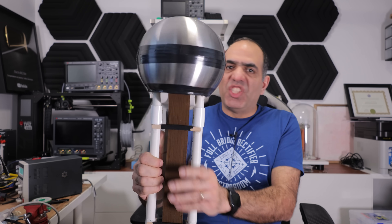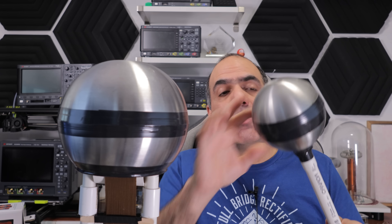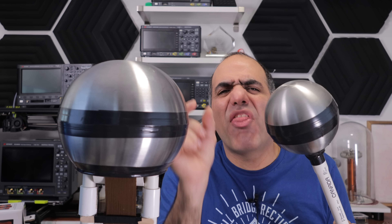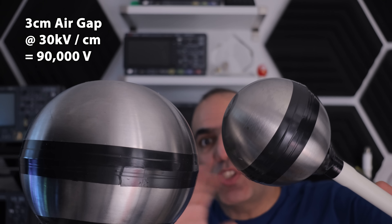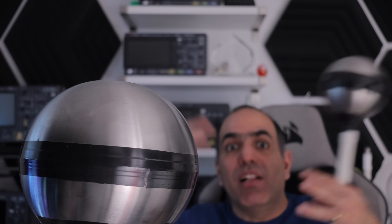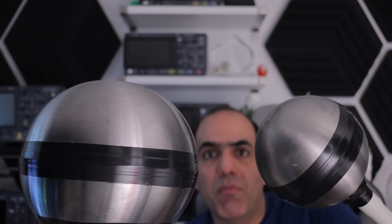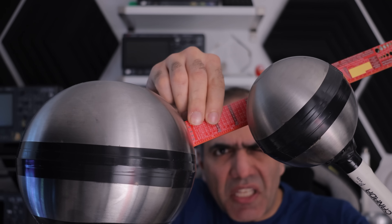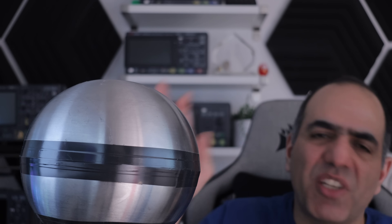Let's move to my Van de Graaff. This is DC, so no filtering required. I googled to see what is an accurate way to measure super high voltages, and they mentioned arcing distance between metal spheres. Because voltage around the sphere is pretty uniform, and we know in that case the air breaks down and arcs at around 30,000 volts per centimeter of gap. So right now I'm holding a distance of around 3 centimeters between the balls, which means the voltage between them can only rise up to 90,000 volts. But how far can I go if I allow the voltage to build up on the balls? Around 6.5 centimeters, so like 200,000 volts. Of course, 30 kilovolts per centimeter is not super accurate unless you can maintain the air pressure, humidity, temperature, and stuff.